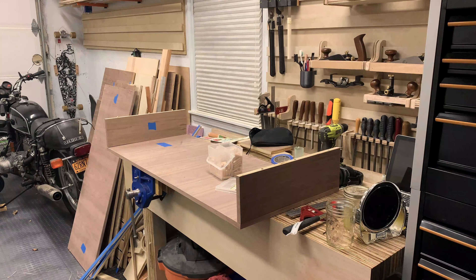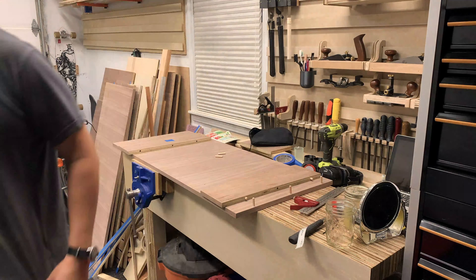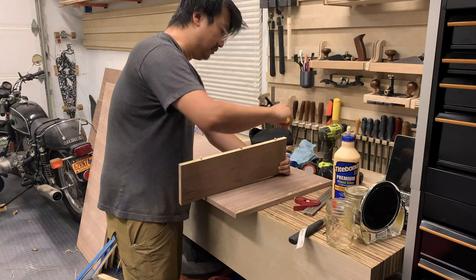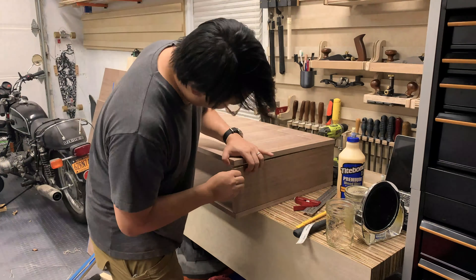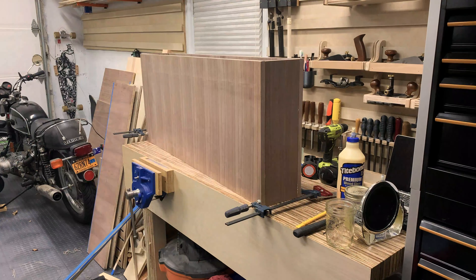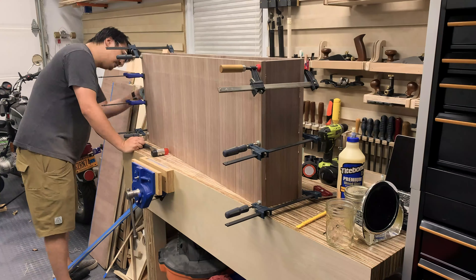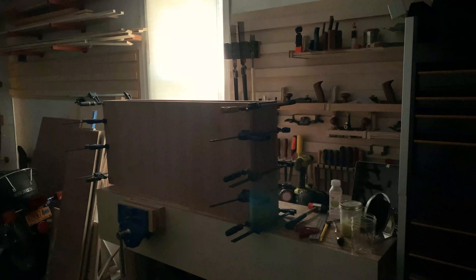You can see me putting in the dowels and they line up perfectly. Now I'm doing a dry fit before the glue-up to make sure everything sits the way it should — I just don't want glue sitting there and then find something's not working. So now I'm gluing everything up. With glue you always want to clamp everything down to make sure you have even pressure to hold all the pieces tight together and the glue will do its thing. Once clamped, I let it sit overnight.